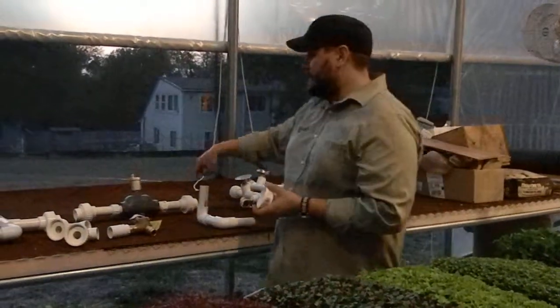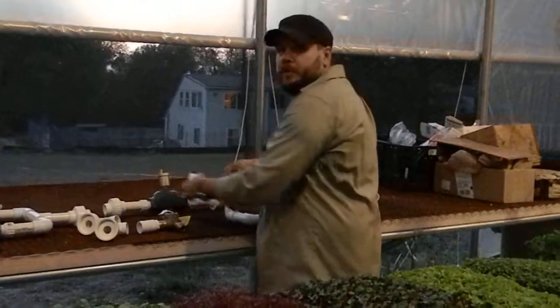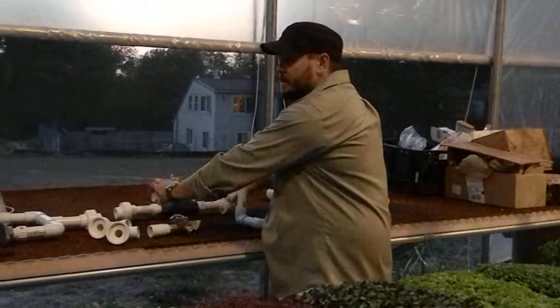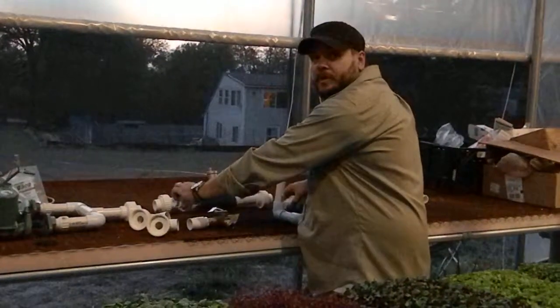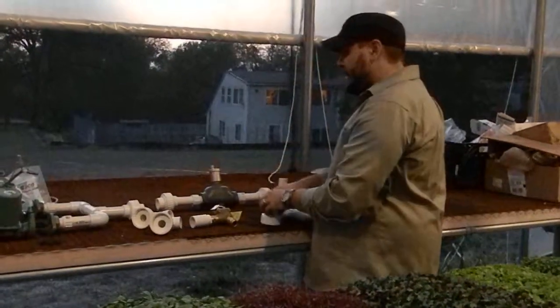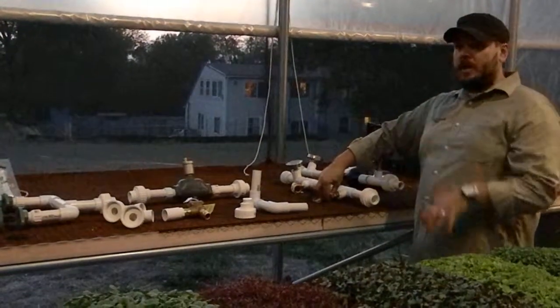So if you imagine that this air scoop module is plugged into the system, I need to take it out. What I can do is break both of these unions, take these 2 end caps, and put the end caps in between this system and the remainder of everything so I can keep all of that water in the system. When you're servicing it, it's probably a good idea to put compressed air into that system to purge all that water out.